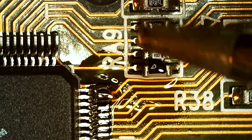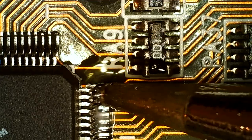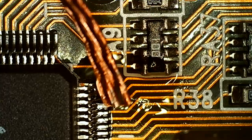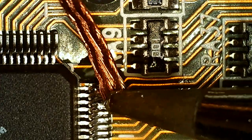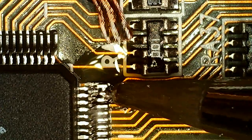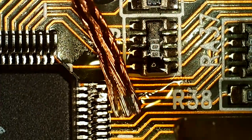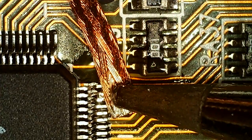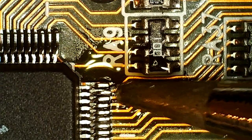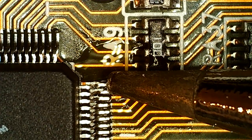One of the cards I've been playing with is also doing similar things, but it's the Voodoo2 I got. It looks mint, everything checks out, pins, everything. But it also causes no post, but it's worse because the computer says not FF, but it could say FF, the post card lines, basically like no CPU. But the system is working as soon as I take it out, so yeah, there's something, it really screws up the PCI bus.